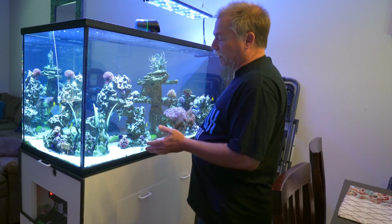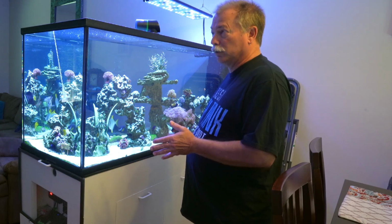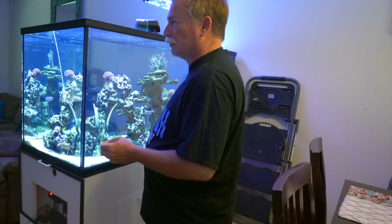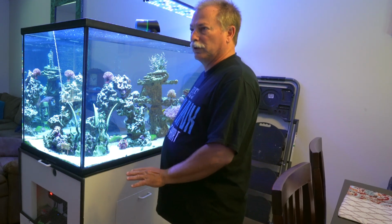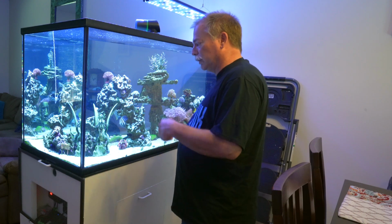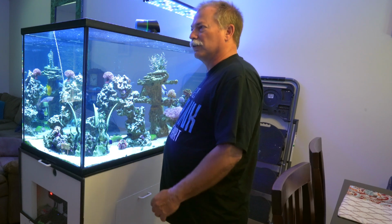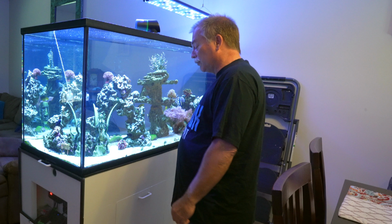This stand is built out of mostly 2x8 lumber, laminated with 3/4 inch cabinet plywood. It also has 3/8 inch by 1.5 inch stainless steel spines embedded that run all the way down the length. So it has no vertical supports down the center of the cabinet whatsoever. The stand is my design, I built it, and it'll support 16,000 pounds at the center with less than a 1/16 of an inch deflection. Wow. So it's a very rugged stand.